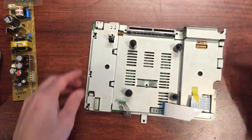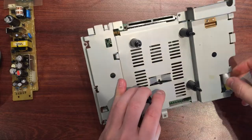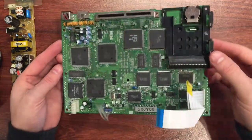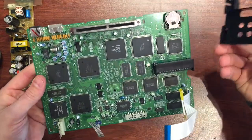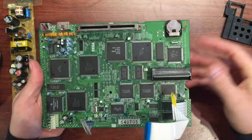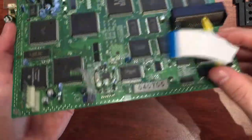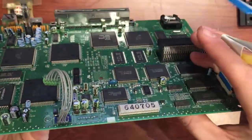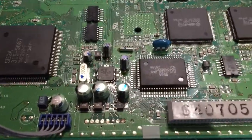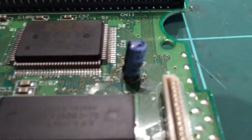Let's put the base aside and we'll lift out the motherboard. We might just have to lift a bit of tape up and feed it through - okay, we're off. It's good to see there's not that many caps, well there's a few but not too many. This section is the tray for the card reader - there's actually a card reader in the back of these for expansion things like video CD. Let's look at these caps one at a time and check if they're bulging. I'm having a look at some of these caps and they've got a bit of a domed top, so I suspect that's a good starting point.